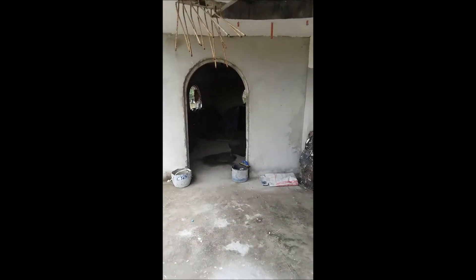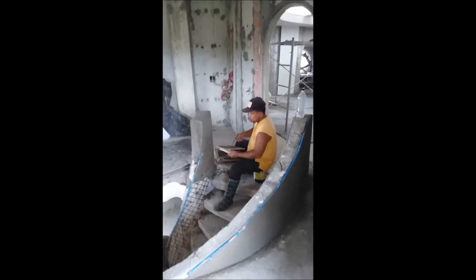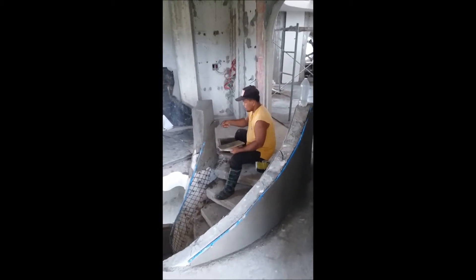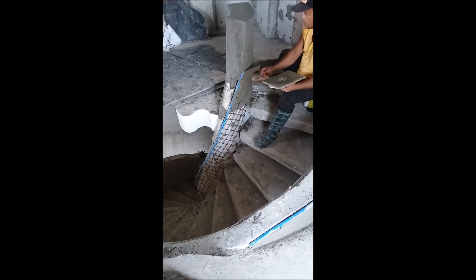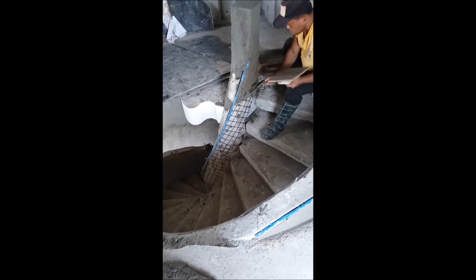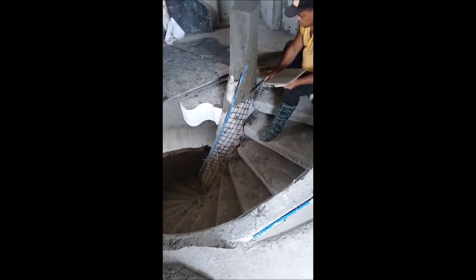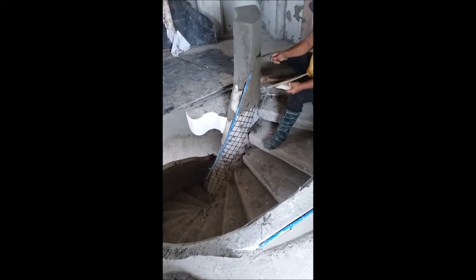This has a door put in it, but that's not the reason for the thing going out the other way. Inside this door is an actual room with two windows, one on the side. Right now it's a storage bin for ornamental iron. There's a two-inch number nine welder wire mesh on the inside handrail. The vertical height from the tread up to the handrail is the same on both sides — it just looks shorter because it's so steep and falls away so quickly.